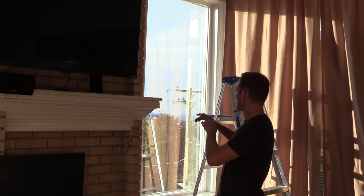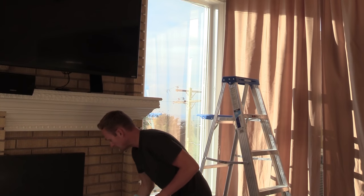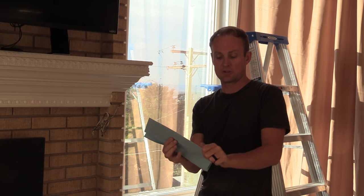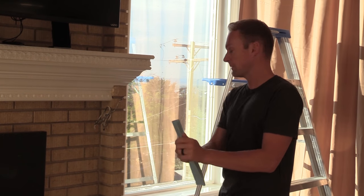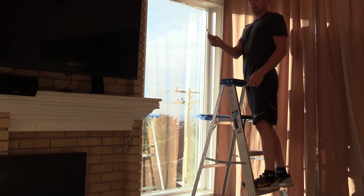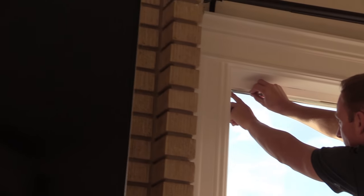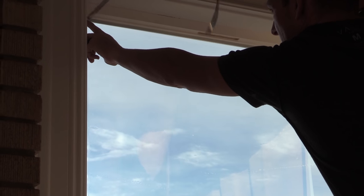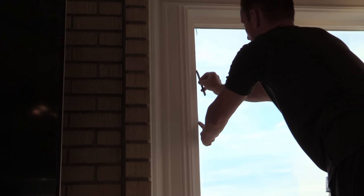If you leave little pieces of moisture, that's okay — I'll show you in a minute why. Get about 90% of it out from behind it. Grab a new paper towel and take your hard card, wrap the towel around it. Make sure the edge doesn't have wrinkles — keep it tight, holding it in your hand with your thumb for a nice edge. Take your Olfa knife and poke out a little bit of blade, about a quarter of an inch. Hold the film to the window and run your knife across the top. Grab that strip and tear it off. You've got your top edge cut.